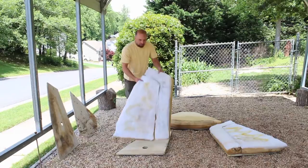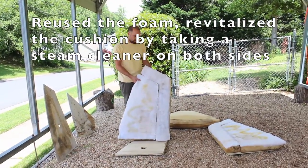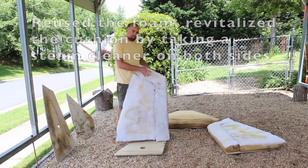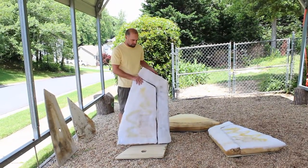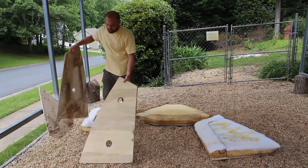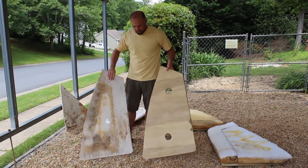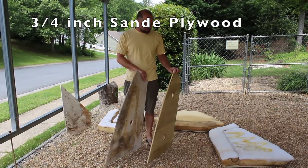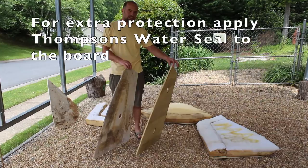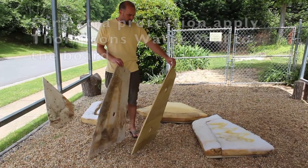We are reusing the foam that was inside it because it was in pretty decent condition. I took a steam cleaner and steam cleaned all the sides really slowly, and the steam helped puff it up about half an inch, just to restore it a little closer to new. The new cut pieces I cut would be exactly like the other one, although I went with three-quarter inch sandy plywood, which is supposed to be better for marine use — for heat, water, and preventing decomposing.